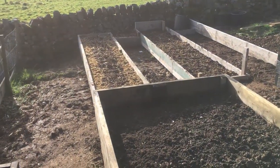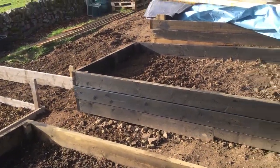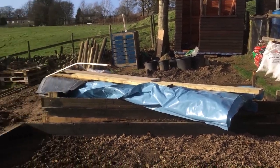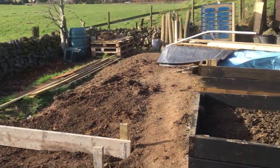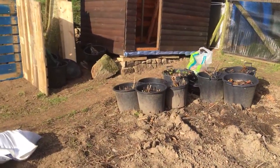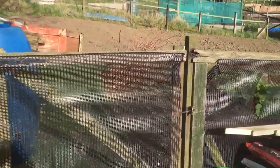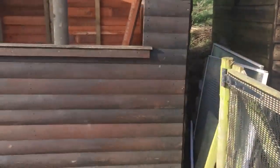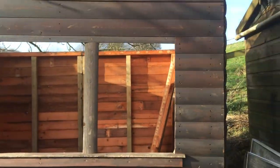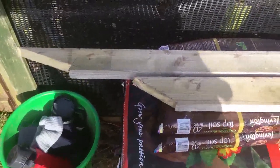It's now Wednesday. I came up on Saturday and put the shed frame up. I booked the day off today and I've been here since half past seven this morning. I've just leveled all the shed up - I'm going to have to fill in and put some bricks in. I've put the ridge on and I've cut the templates for the rafters for the roof.